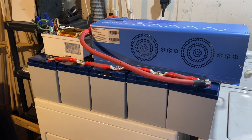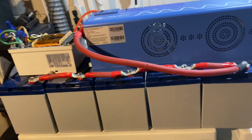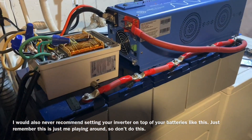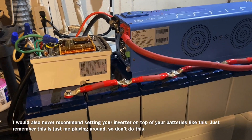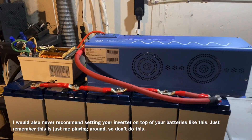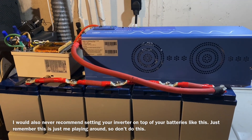I also don't have some critical things on this setup. If you're going to do this as a permanent situation, you would want the appropriate breakers, disconnects, and battery monitor in place. This is strictly emergency use, and I would never recommend tapping into a dryer outlet professionally — this was just me getting bored and wanting to play around. But it's kind of cool to see what you can do: take 120-volt from this inverter, convert it to 240, and power the whole house through the dryer receptacle. Anyway, if you like this video, like, subscribe, and share — get out there and experiment as much as possible, but be safe when you do it.